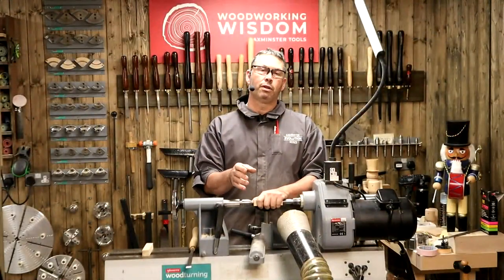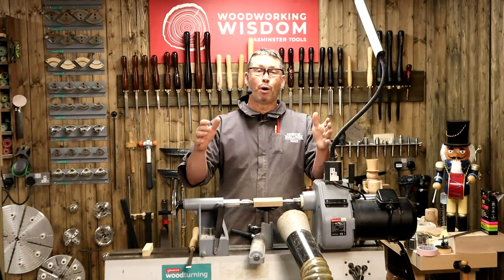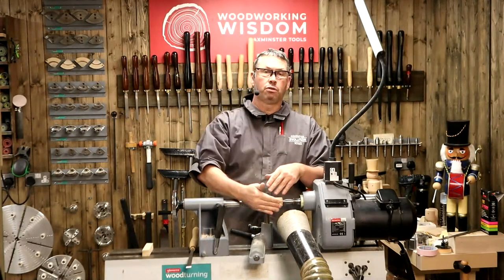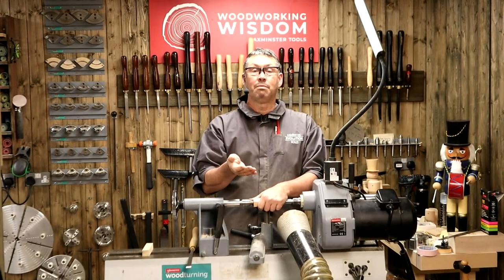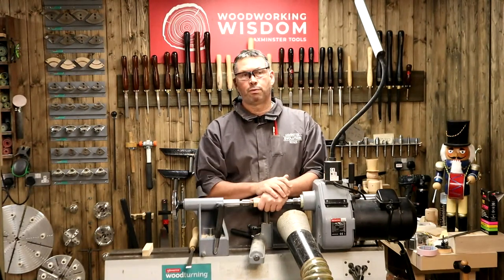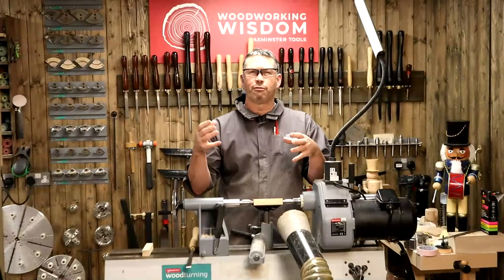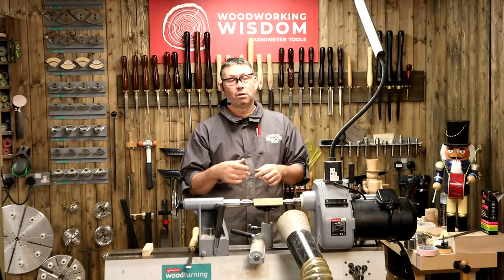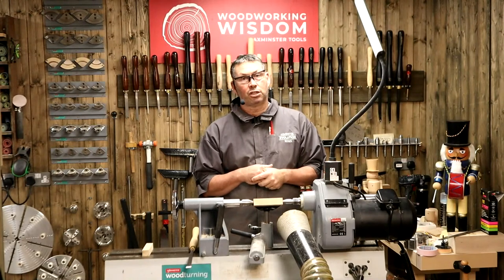And don't forget, there's a lot of myth about wood prep from a tree. Your bowl blanks do not come from slicing a tree across it. They come from the side of the tree. So you're converting timber. You almost want to pretend you're planking, and then your timber comes from that. Okay, so in terms of drying time, if you cut it now, it's probably the right time because we're going into winter in the UK, and it's not going to be subjected to all that heat from direct sunlight, all those sorts of things. So get it into as small sizes as you can that you want to use, rough turn where possible, and store somewhere out of direct sunlight, but with a bit of ventilation so it doesn't go moldy.